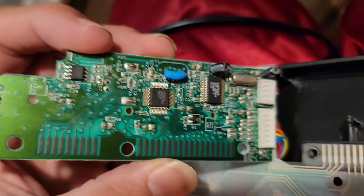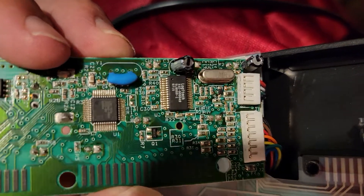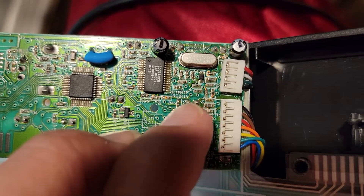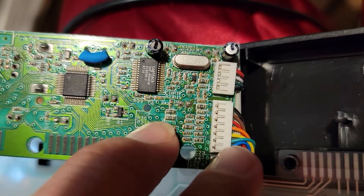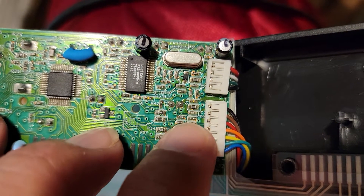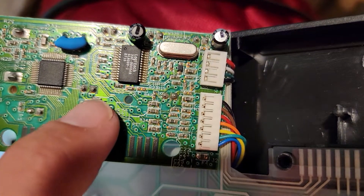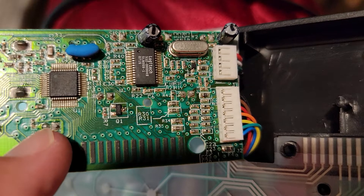There's the board pull. I'm going to zoom in — looks like this solder joint is the problem right there. Looking at this area right in here, this is what I was looking at earlier. These two solder joints here — I was getting an intermittent problem. I pulled this connector off to see, and it was straight, so that's not it. It could be any one of these, and resoldering them is time-consuming. I didn't catch it right away since I wasn't using the keyboard every day.